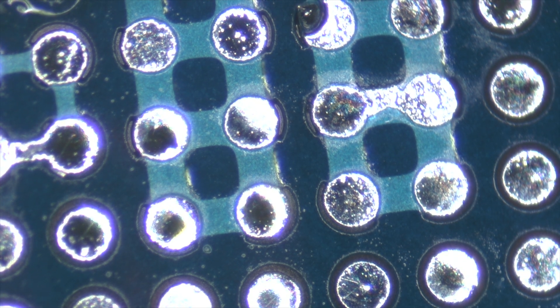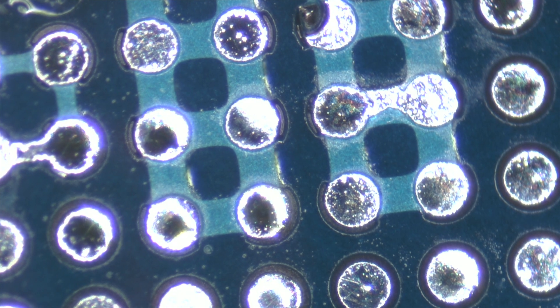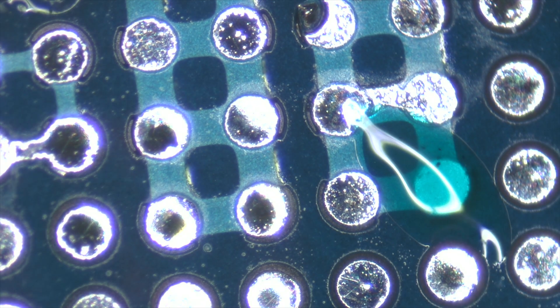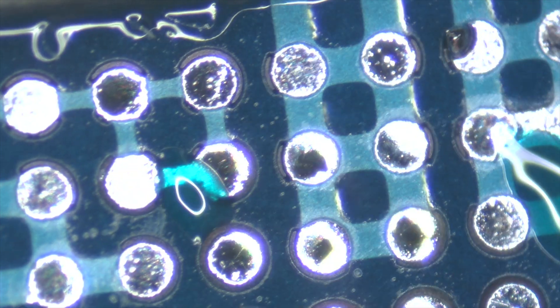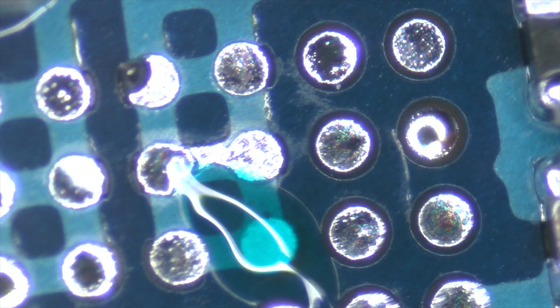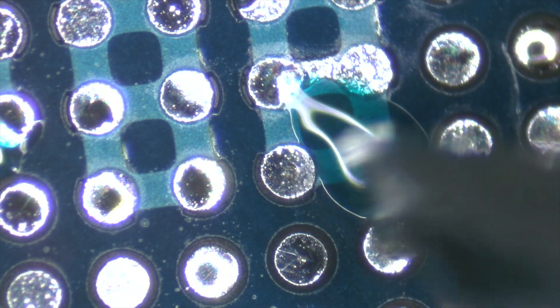Here is another trick. When there is a gap between two balls, practically the paint has been lost. If you don't want to have problems when you are soldering the circuit, you should apply a UV mask and cure it. In this way, there is no risk of the balls bonding underneath when you are soldering the circuit.